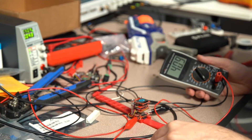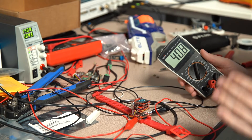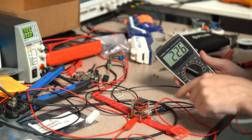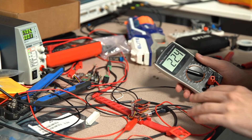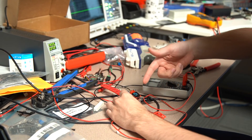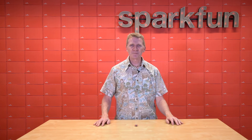I've removed the battery so we can connect to an external power supply to measure current consumption from the entire stack. In wake mode, the current consumption is around 40 milliamps — I could probably optimize that. But after 60 seconds, it automatically enters deep sleep, and the current drops so low it's off the measurement range. Dropping the range down, the entire stack of boards is drawing just over 22 microamps — and most of that is coming from the processor. The BMA400 accelerometer is still active waiting for a double tap, and when it fires an interrupt, the C6 wakes back up. With a 400 milliamp-hour battery and 22 microamps of consumption, it could theoretically last two years in deep sleep.